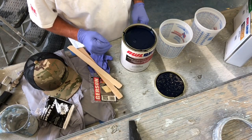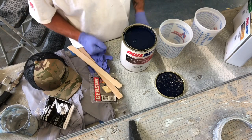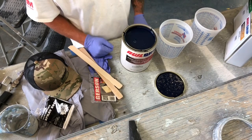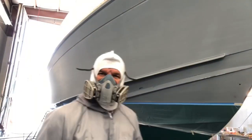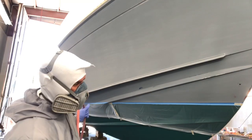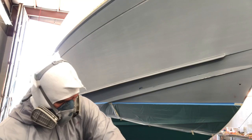So with that being said, I'm gonna go ahead and mix this. I'm gonna allow it to induct for 15 minutes, then I'm gonna thin it. And while it's inducting, I'm gonna go ahead and tack rag the boat and get it ready so that I can just get this process done. So stay tuned, see you soon. Okay everybody, here we go. 3M AkzoSpray, Awlcraft 2000 Corinthia Blue.